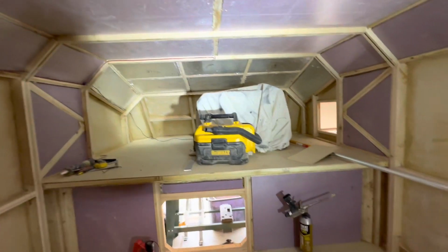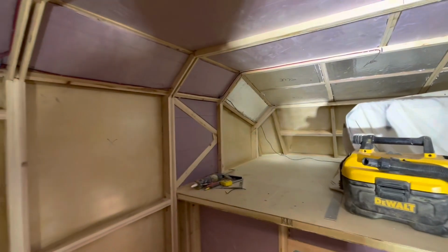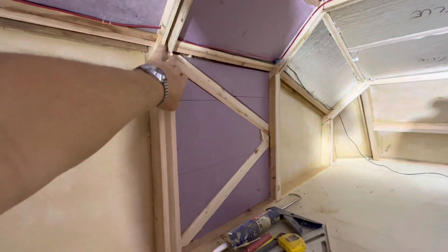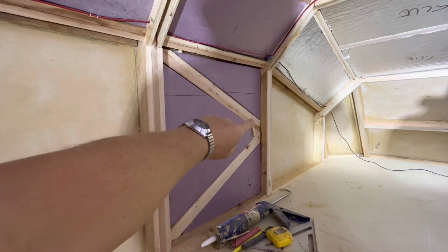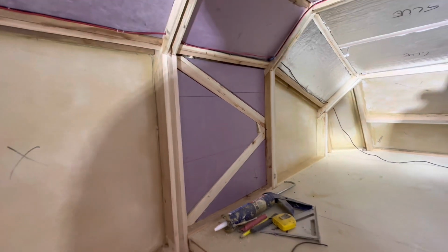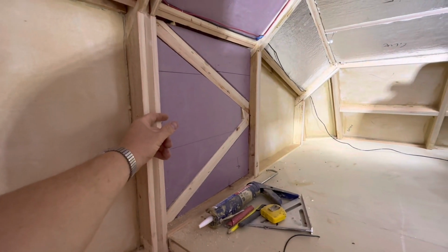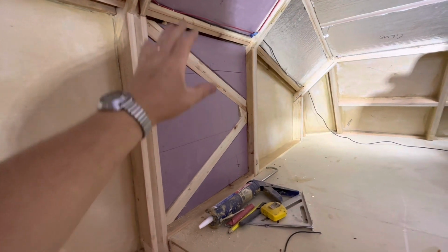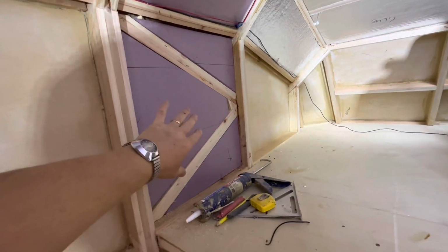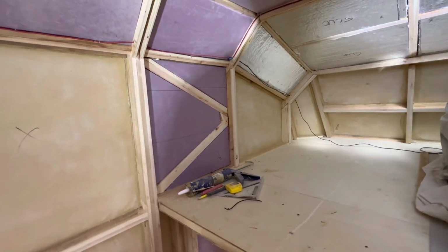Anyways, so we talked about the insulation on the roof and some of the trim pieces I'm going to put up there. This is the reverse K structural supports here that I incorporated when I made the framing. These are 1 inch deep, so this is just an inch thick XPS. What I will do is I'll have a 1.5 inch piece of EPS, which will be covered in the fabric and will fit in that cavity and cover this up. So if you're on the inside looking, you will never know that there's that structural piece there.